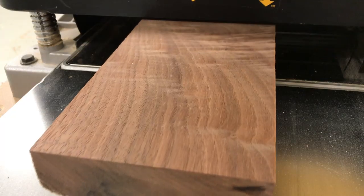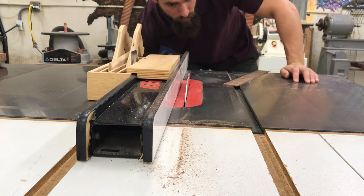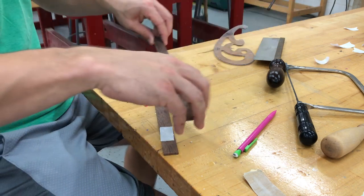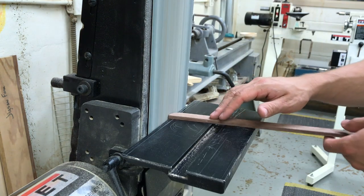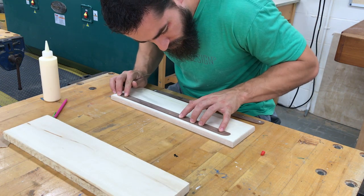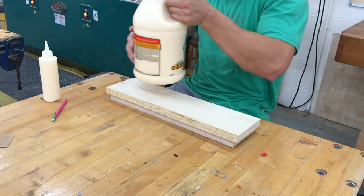I started milling up some stock to make the feet — I wanted to give it just a little bit of lift off the ground. I milled them very thin, less than an eighth of an inch, doubled them up with double-stick tape, cut them out on the scroll saw or band saw, and took them to the belt sander to shape them. Placement matters: too close to the edge and you'll see the feet; too close together and the board wobbles. I got them as close to the edge as possible without being visible. You can also use a heavy bottle of glue as a weight clamp — pro tip.